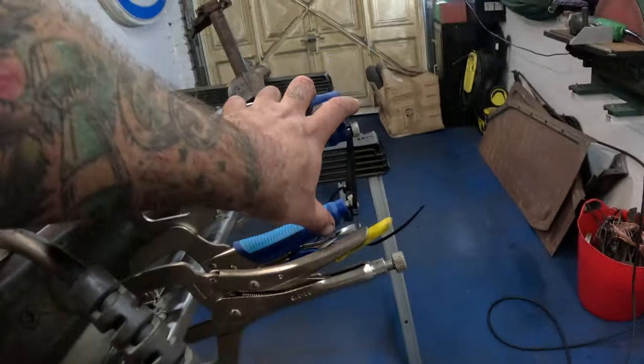Now we're onto these ovalised holes here to get the pedals through. Already done that side. You might have already figured it out. Those holes are the centres of that, basically. So go in with a hole saw, but the trick is take the drill bit out of the centre and turn it round so that this drill bit doesn't start eating into that hole in it, and it sort of wanders all over the shop. So it locates into there.